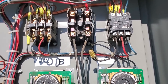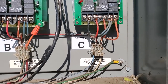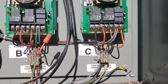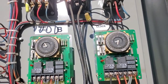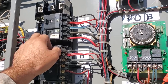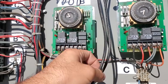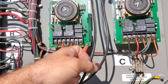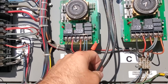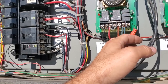So that's one thing, but I've just kind of evaluated everything before I jump into this, because this is kind of a mess. I'm trying to make sense of what's going on here downstairs with the wiring and everything. The difficulty here is that they have a separate power source for the defrost heaters right here, and there's going to be separate voltage for the defrost heaters. I've got to figure out what they're doing there because the wire size is changing, which is strange.